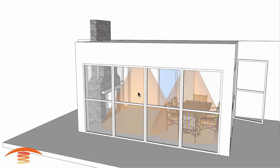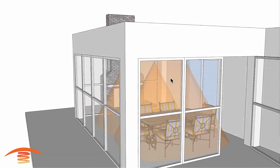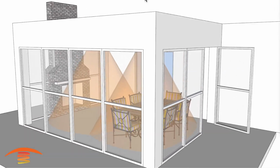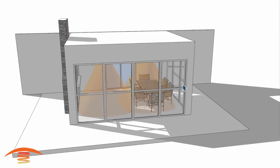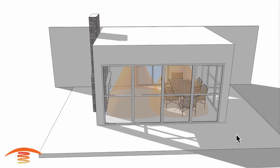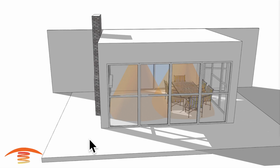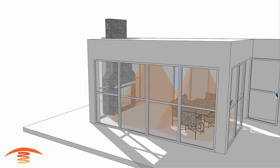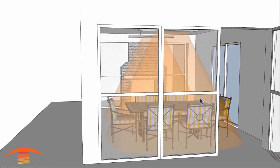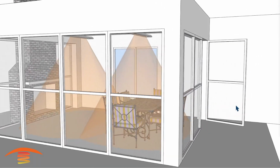But although it's a little bit warmer as far as the air temperature, this is heating up mass. This is infrared light waves. So if I showed you, for instance, if it was a sunny day, the sun's coming over here, you're in the shadow of the building, you're not going to feel the warmth of the sun, but the air temperature here and here have not changed. If you're standing here, you feel the warmth of the sun, and that is exactly how the heaters themselves work. They are light waves, and as long as you're in that beam of light, you will feel the warmth of the heater itself. So, all right, well, I hope this has helped.